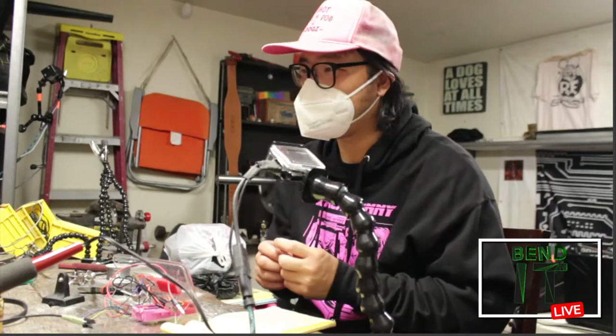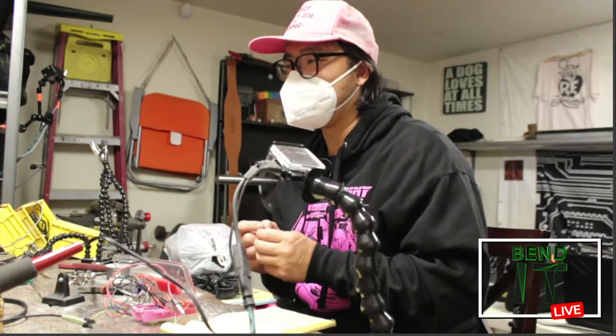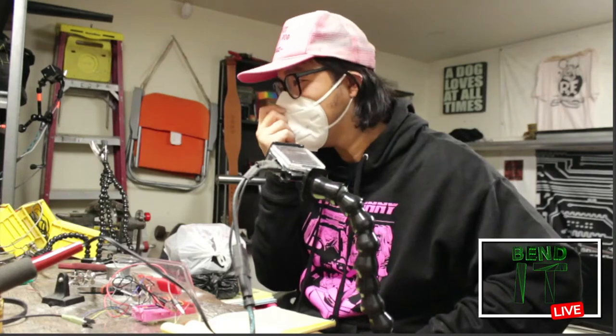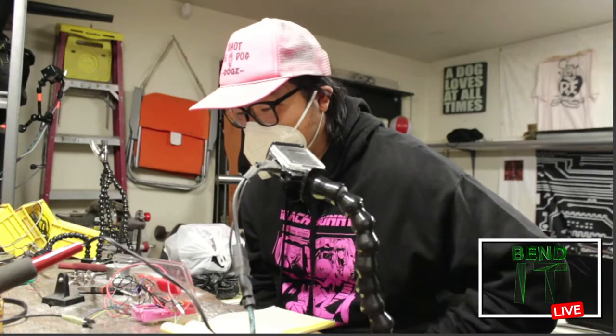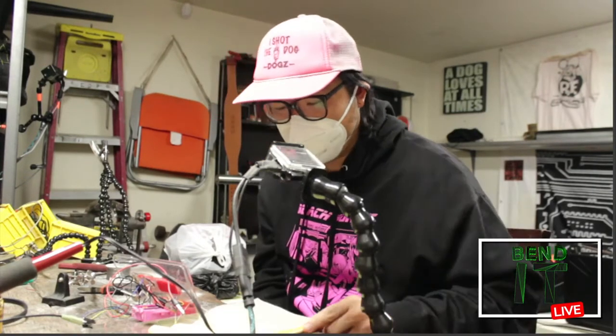And there's also the added factor of when you're holding your probes, there's added natural resistance from you, because your body's part of the circuit. So you don't fully know what's going on until you solder those leads and clip something on. So now that I've done that, I'll revisit some of these.